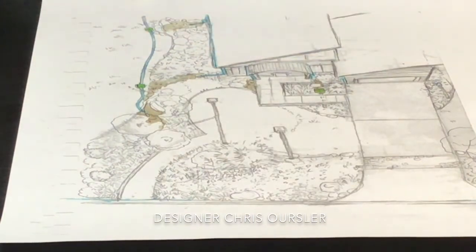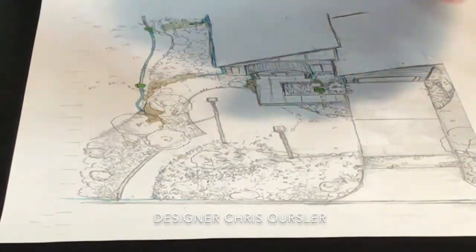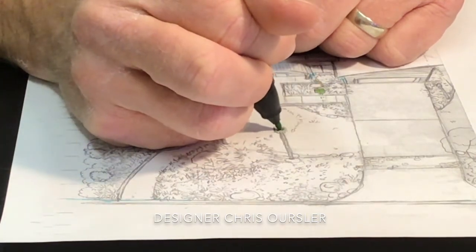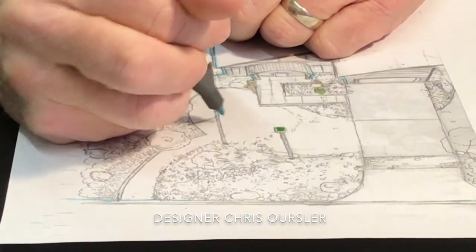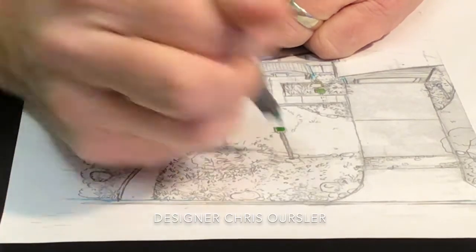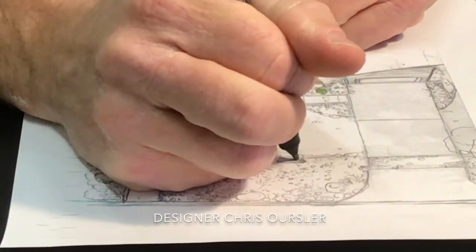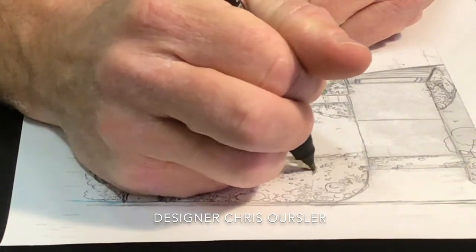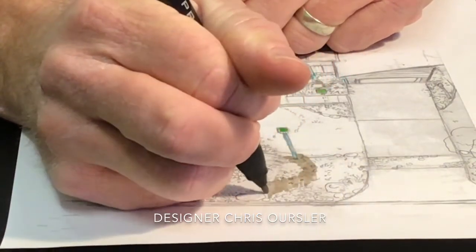So we're creating a series of drain inlets all over the property, using grading techniques, grading your yard properly, giving yourself little areas where the water drains into these service pipes that then daylight out into areas that we want to steer the water to, into these cool little bioswales. And we make these bioswales, these splash points. What I've done here, these little splash points are combinations of cobblestone and river rock and little naturalized boulders.